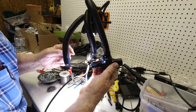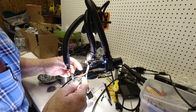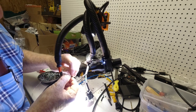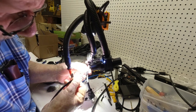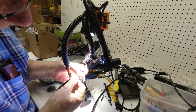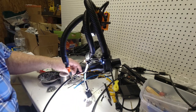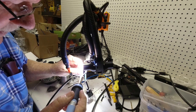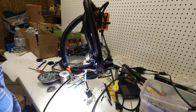I've got the helping hand set up, got my exhaust here for my soldering, got a clamp holding one piece and another holding the wire. Now what I'll do instead of twisting these — I'll keep these straight and then I will actually push the strands together like so, take my soldering iron, dip it in a little bit of rosin.